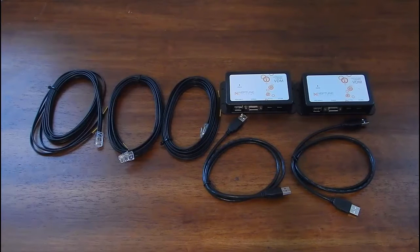I had to go out and buy some additional equipment because I ran out of variable speed ports on the Apex itself. I have four JBO pumps hooked up already, which uses all four variable speed ports, so I had to buy two dimming modules and three cables to connect the lights individually. You can connect lights via daisy chain, but I'm doing each one individually for more controllability. You can daisy chain two or three lights before it starts impacting the power the light receives. I'll also show you how to do it with an ethernet cable so you don't have to buy those if you don't want to.